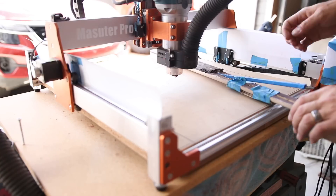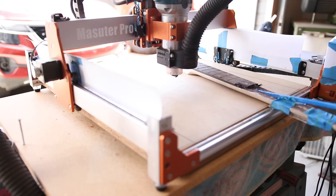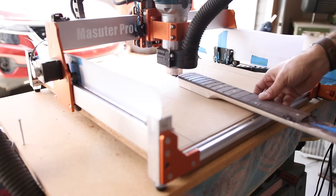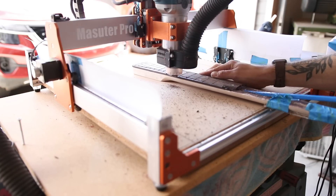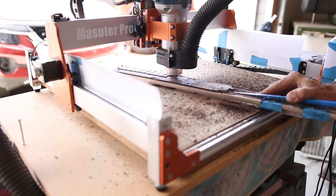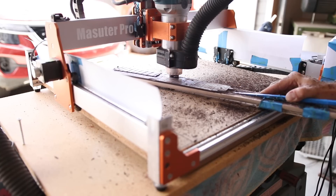Here's another reason why it's extremely helpful to have a simple desktop CNC machine. I'm just going to leave the CNC turned off and just use the router as a sled, and I'll slowly guide this through here. Not looking to plane it down perfectly smooth — that'll be the following pass. I just want to get the wood off, get the truss rod out, and then we'll figure out how to flatten it.